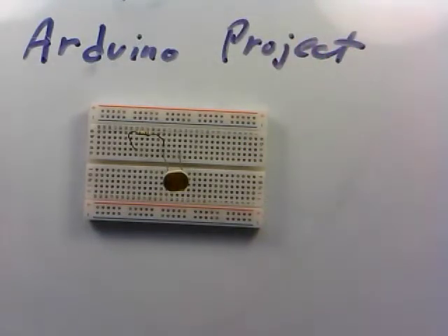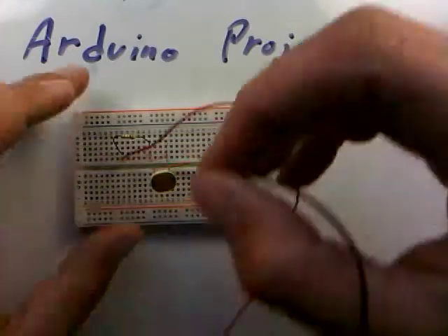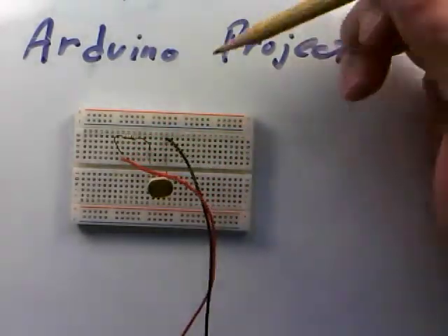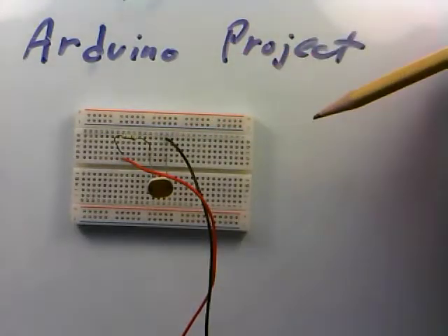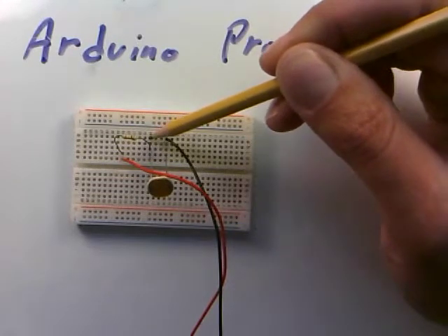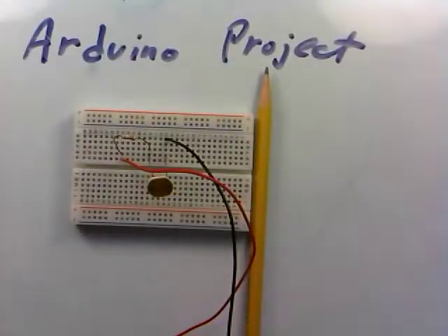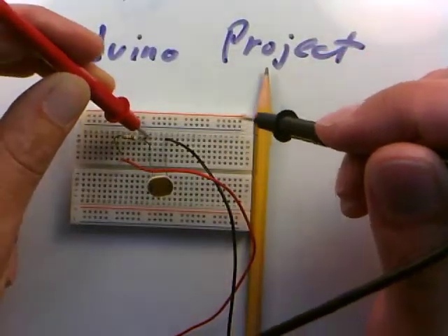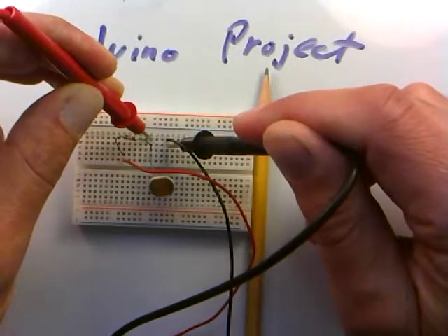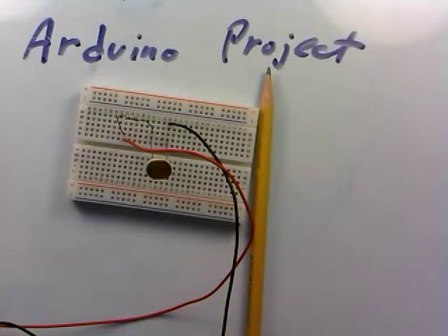From things we've discussed about voltage dividers before: if I powered the circuit using my 9-volt battery, I would get 9 volts across the whole circuit, and this middle point right here is the voltage divider spot, where the midpoint voltage between here and where the black lead is would be some fraction of 9 volts. That would depend on light intensity. If I wave my hand over the photocell and put the voltmeter at the midpoint, I would see the voltage vary as a function of light intensity — an electric circuit whose behavior depends on light intensity.